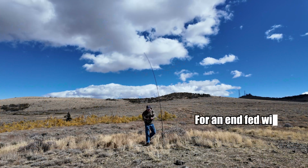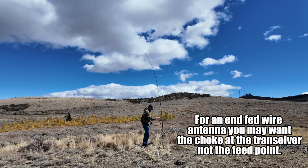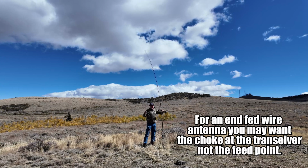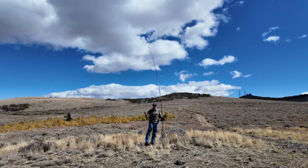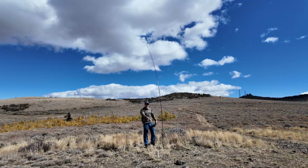I'm going to go ahead and take my coax, and then I'm going to put my choke side to my 9-to-1, run the other side to my Xiegu G90 and see if we can't get activated with 20 watts and a Slinky, so stand by.